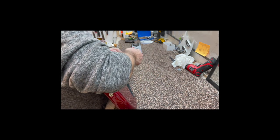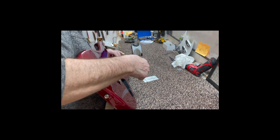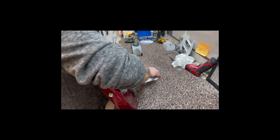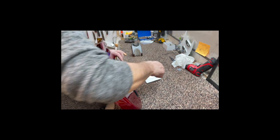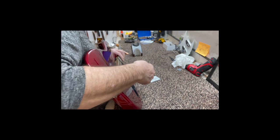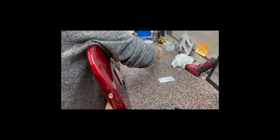So the first thing I've done tonight off camera is I've made up a rosewood insert and put that into the original slot. And then I'm going to reposition or mark a new slot going in the opposite direction. And then I'm going to need to set up a little jig on top of the body and route a little slot 3 millimeters wide across the top in the opposite direction, atop of the bridge. So that's going to be interesting. I've done a little trial run on a spare piece of wood and it's not impossible at all to do, so I'm looking forward to doing that. And then, really, it'll be a case of giving it a buff around because it's a bit grubby at the moment. Get it cleaned up and strung up.